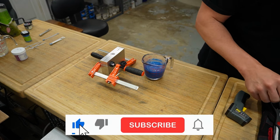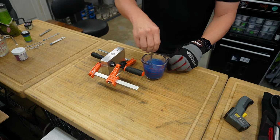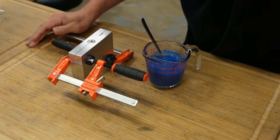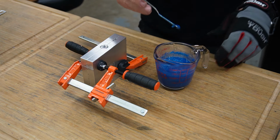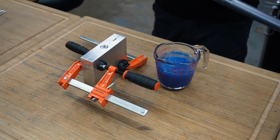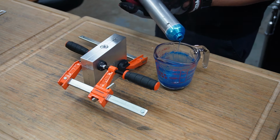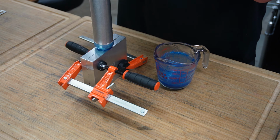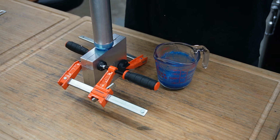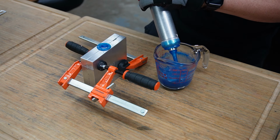Alright, what is our temps here? 367, perfect. By the time we get to actually shooting this thing, cold injector, it will probably be closer down to like 350-ish. And even that's probably a little bit warm, but that's alright. Okay. And again, hardly injected at all because it's such a small mold. I am holding pressure here just to make sure that I can encourage the bond. And that should do it.